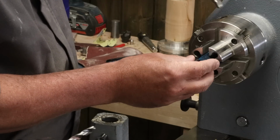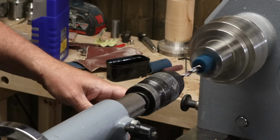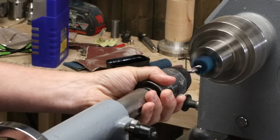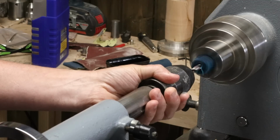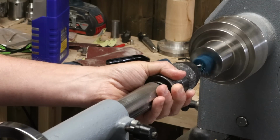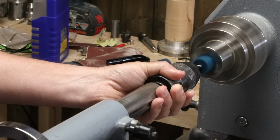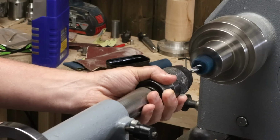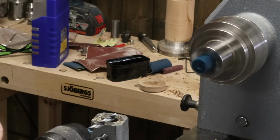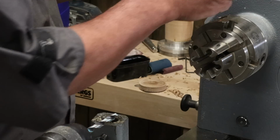Even though we're going to ream them, we're going to use the best 2. So let's just grip them in the pen jaws, and this is going to just drill through ever so easily. So through we go. It's a lot harder to drill now because we've got it stabilised with the glue. All the way through. There we are, just passed through. So we need to do that on the other 2 as well. I'm going to keep going with 3 just in case at whatever stage one might break down or might have a problem with one of them. But we can always keep that other one for a single barrel pen kit as well.